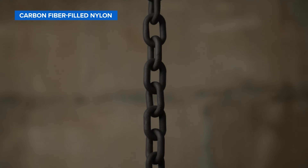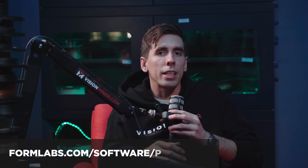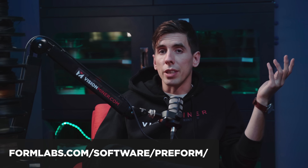If you have a part in nylon, flexible, Nylon 11, glass-filled, or carbon fiber, the cost of an injection mold will surpass the entire SLS system very quickly, depending on the size, the shots, and how many versions you do. If you're paying $10,000 for an aluminum mold for your nylon parts but you only need 10,000 of them or so, you can download the software for free and throw your parts in to see how many you could fit — it's really easy to calculate. And for a lot of businesses, it's an amazingly good option.